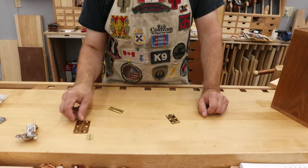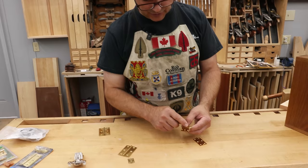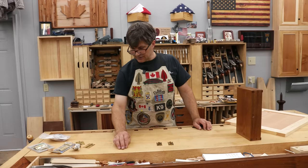I sometimes think the cheap ones are actually designed so you don't even have to mortise them — just slap them on the surface, which is not what you find in quality work. You want the ones that are extruded, not stamped. Typically they're made out of brass, but they can come in other metals. You can get them polished or brushed — that's personal preference. They're held on by three screws designed to be countersunk, and you're going to want brass screws there as well. These just give you a much finer job. However, there's no adjustment after you've installed them. Don't expect to find these at your local hardware store — you usually have to order them as specialty items.